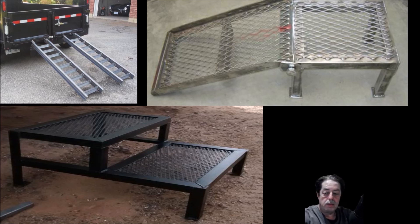I get a lot of comments and emails — the question they ask a lot is, 'These look like they're too hard to make.' Well, not when somebody talks to you a little bit about it. Let's look at the upper left again — that's just angle iron and channel steel. He took his time, probably set it on a concrete floor, drops in the angle iron pieces. If you have it set up on the floor you can duplicate these real fast and real easy, or you can just mark them, measure them, and weld them in. It's not that hard. If you have a welder, just go out there and start making them.